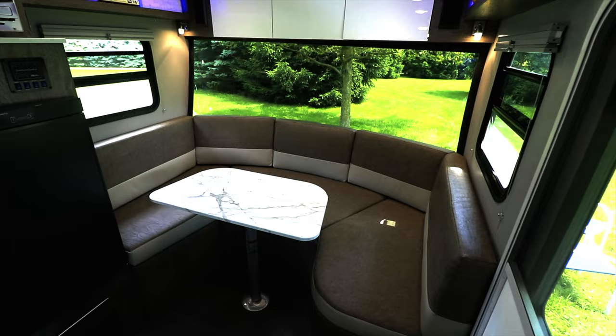Back here in our cabinet shop, as I mentioned earlier, everything is custom made for our products. It gives us a lot of control to maintain quality to our standards. Most everything gets laminated upstairs — we do a laminate over a melamine or a lumber core board. We bring it down here, it goes through the CNC machine and gets cut, and then our guys assemble the parts and pieces and feed them off to the production line.